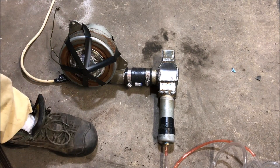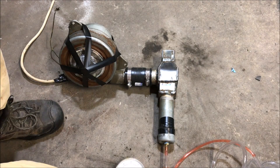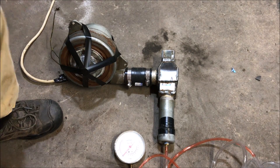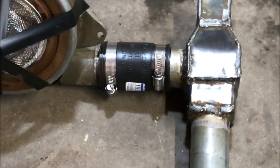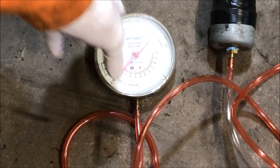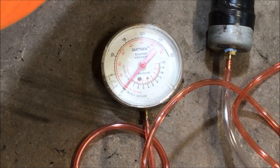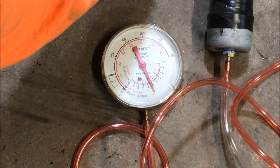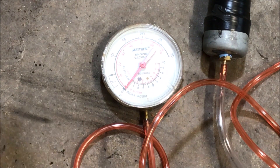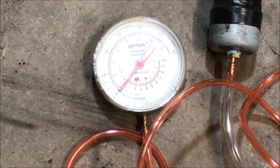Okay fellas, so this is what we got. I connected a vacuum gauge up, but it isn't powerful enough to draw a readable vacuum. It does pull a lot of air. I just wanted to show you guys how much boost we're getting off of this compressor for future reference. This is a two-stage blower — very powerful blower. We were almost able to get five PSI of boost. However, as you can see, it will give us no readable vacuum.